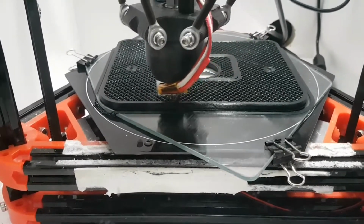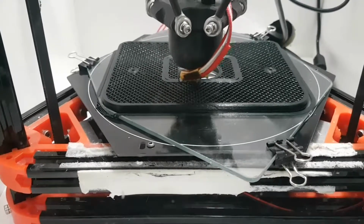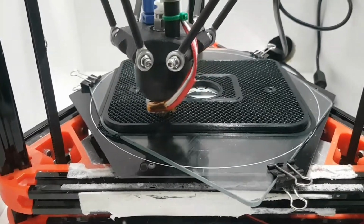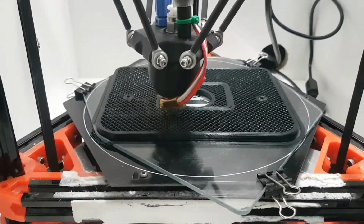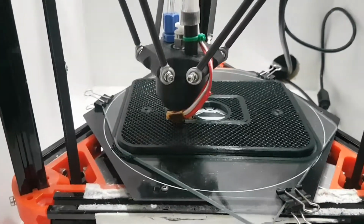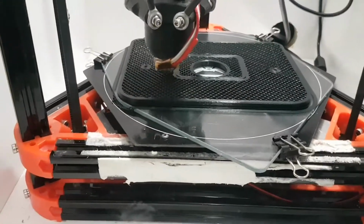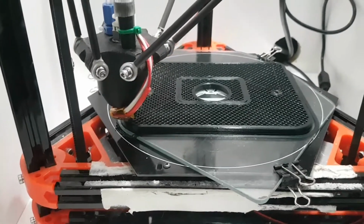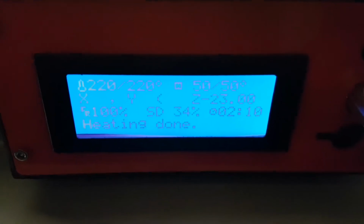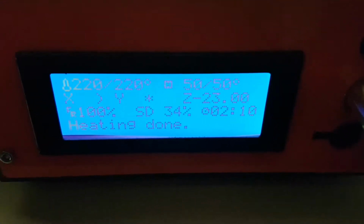Basically 4 wires need to be connected to the Arduino unit, and then you need to update the firmware, which is one part that I really like about these open architecture machines. You can actually change the firmware, and on this Delta it's proved to be very advantageous. I've been able to change a completely different type of feeder on this thing, which operates at a different scale. I've been able to tune the precision to quite a high level, and also now of course I can add the hotbed, or I have added the hotbed, and it's all running very, very happily.